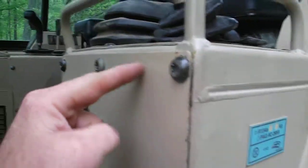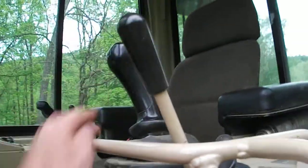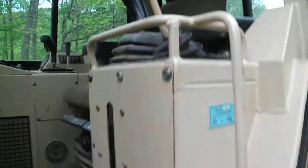What I was thinking is, there's a safety switch on this park lever, and it's in here. You're gonna take these panels off, this panel, and take these bolts out, but it's buried in there. It's up and around. There's an orbital valve in here for this control, and the whole throttle linkage and everything's in there. It's packed around it.